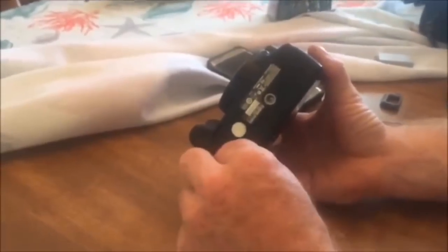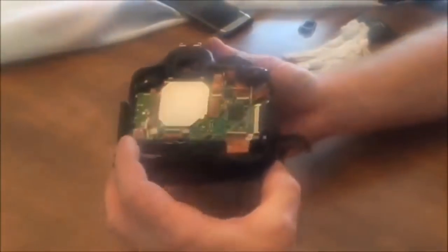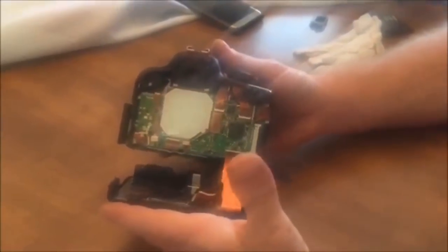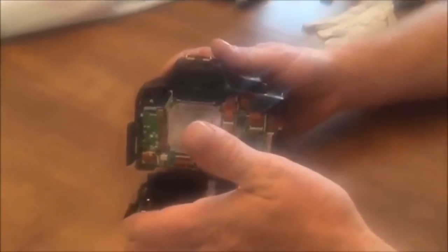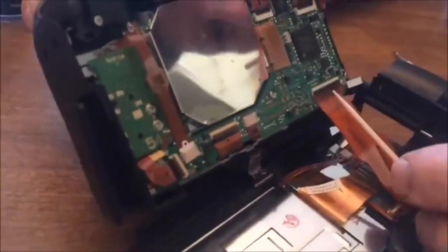You have two main options, a naked sensor modification and a full spectrum one. A naked sensor modification is the cheapest route and simply requires removing the low pass filter. There's a couple drawbacks to this approach. First, your camera sensor will be directly exposed to dust. And secondly, you will lose infinity focus with a lot of lenses. That's because you've taken a piece of glass out of an optical train. On a budget, a tech-savvy individual can make this modification at zero cost. And in the future, you could always install a glass filter in place of the low pass that you took out.